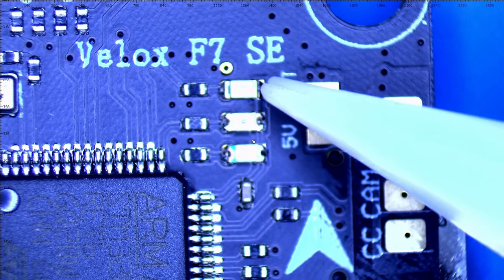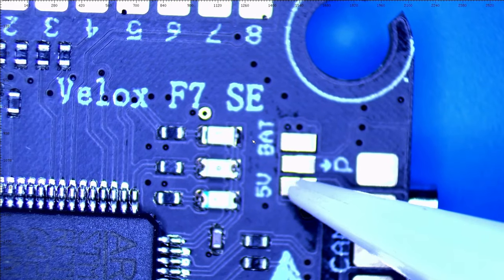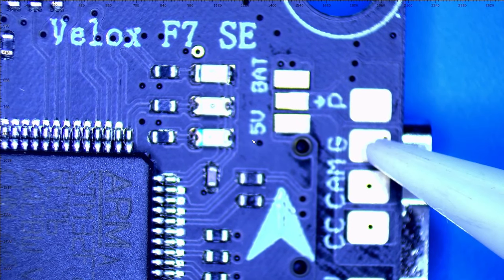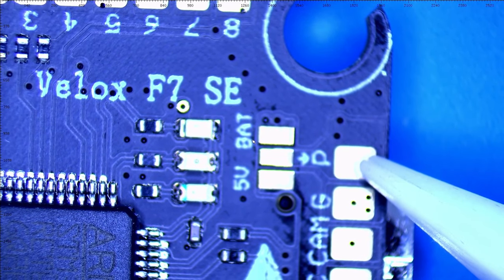Heading down to this side, you've got three LEDs here — don't overlook that. You've probably got one letting you know you've got MCU power, one connected to the 3.3 volt rail letting you know you've got power there, and another letting you know that communication is happening. Now right here we've got our first jumper — it's telling you right here what your power options are. Here's your camera control, your actual camera, your ground and your power. You can jump this over to five volt and make your camera power pad five volts, or you can jump it to battery voltage going to the power pad for your camera.